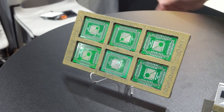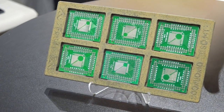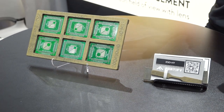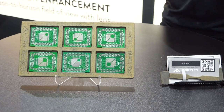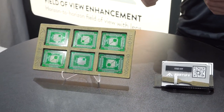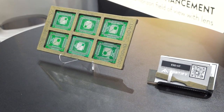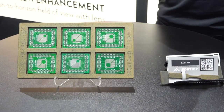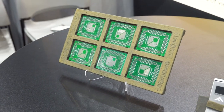Here's our last component and one of our newest — this is an electrostatic dissipative carrier tray. This material can be printed on the same machine as all of our other materials, and it's great for electronics and assembly applications where customers need to create custom carrier trays. It is a high-temperature ESD material that can withstand up to 300 plus degrees Celsius for processes like solder reflow and wave flow soldering. We've had one customer run it through over 1,500 cycles of wave reflow, so we know it's a great material for that application.